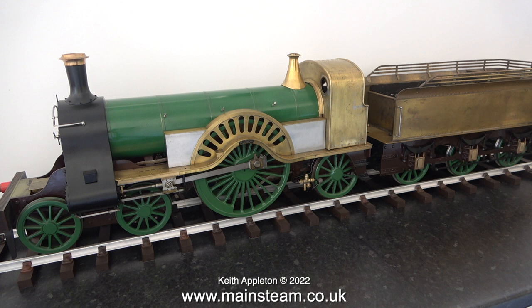The main enemy of any steam locomotive — be it full size or miniature — is oil on the track, and probably to a point snow isn't too good either. To counteract this slippery track problem, most full-size locomotives are fitted with sand boxes that drop sand onto the track just in front of the wheels. You can do this with miniature locomotives, but it's better to spread the sand on the track using a separate machine.